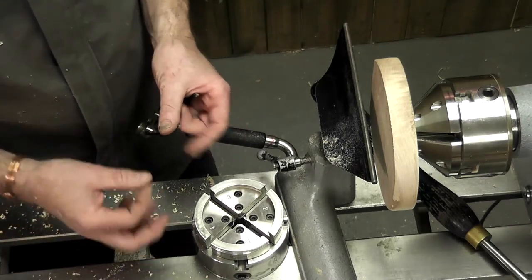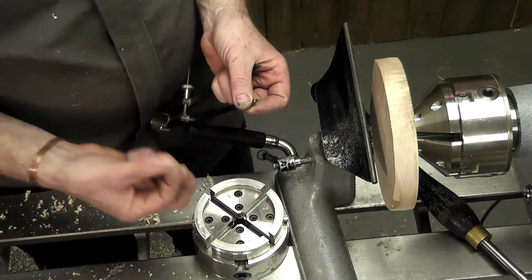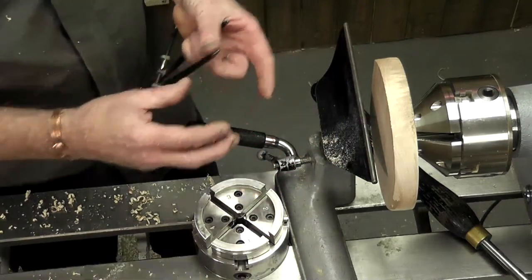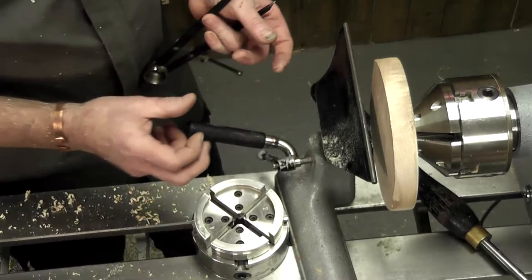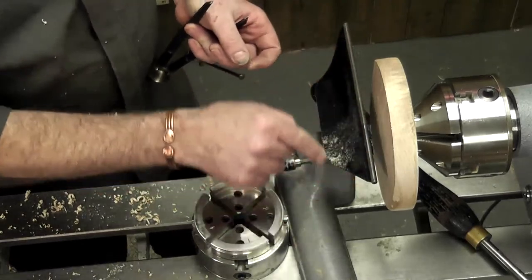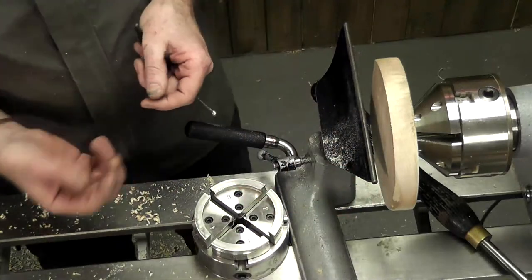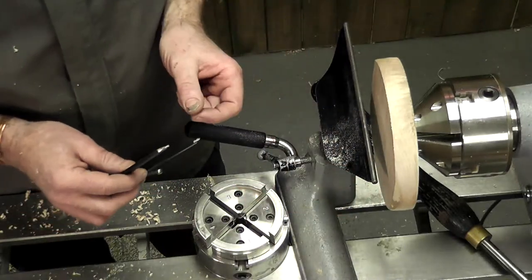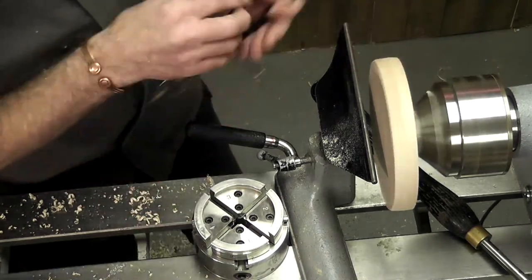But that's actually going to add stability for what we're trying to do with this project, so it doesn't fall over. If we did a recess and expanded into a mortise, if you like, some of you will call that, okay? I'm going to have a little weak rim around the edge. I've also, if you like, put a recess in the bottom of the bowl, which gives me more risk of joining the funnel club when we hollow the other side. So it could be nice just to do quite a large, solid foot.